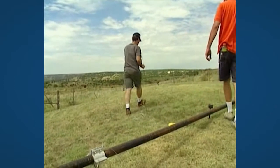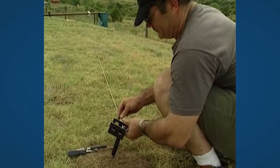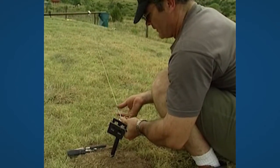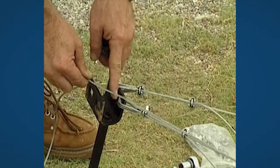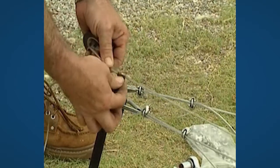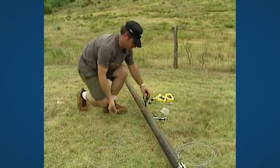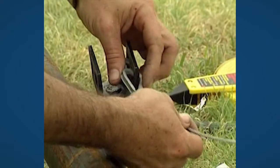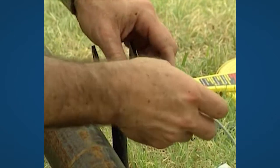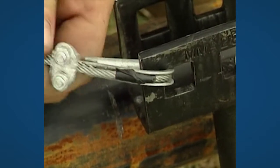The wires must be adjusted to the right length between the wire coupling and the anchors. Measure the length of the wire to the anchor under the pole. Use tape to mark the correct length of the wire. Pull it down once again and tighten it up.